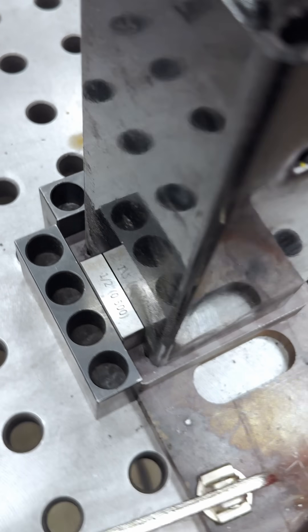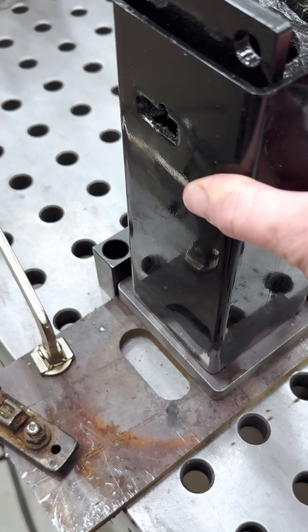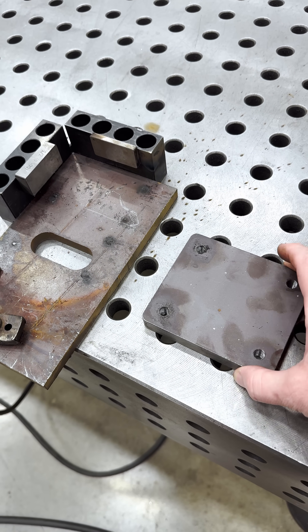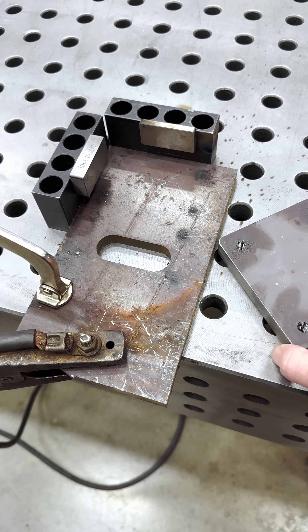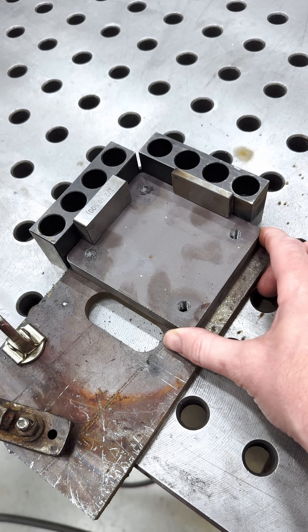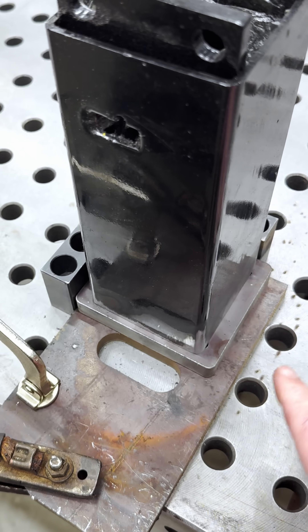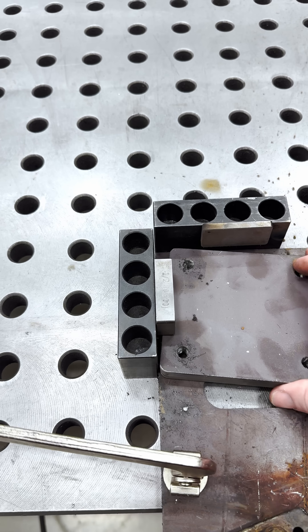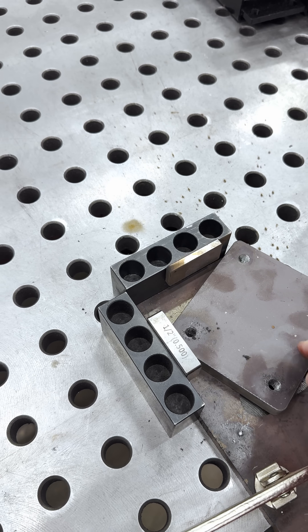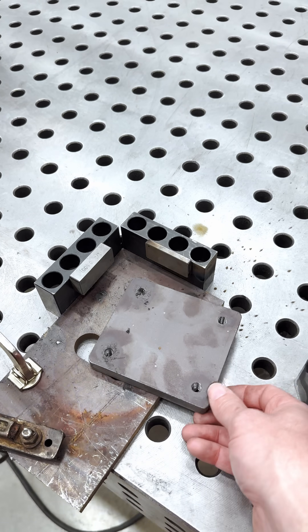I think this is much faster than laying it out. But I know a lot of you guys like to do the layout method, but fixturing really just makes sure everything's nice and straight. I know we can all lay this stuff out, but what I would like to do is hire younger welders and fabricators and give them a jig so they can be successful. Or if you're new to welding and fabricating, you can be just as good as us journeymen by just setting up a simple fixture. It really evens the playing field for everybody and can give the youth and newbies an opportunity for success. That's what fixtures do. And that's the benefit of a fixture table — let's do it fast and consistent. Cool little trick.